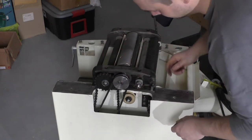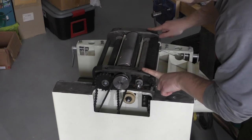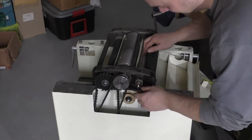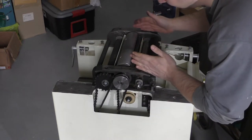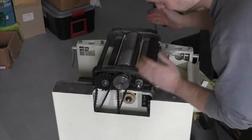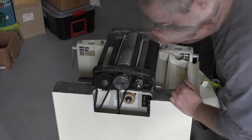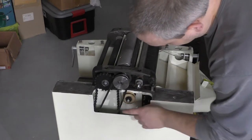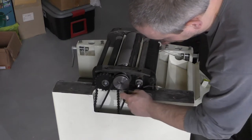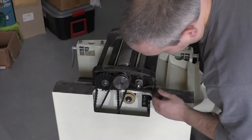These blocks go through the pieces of the frame, so there's no way to get the shaft out without the two parts of the frame being further apart, and the only way to get them further apart is to strip the whole thing down. I think there's still tension on the belt, so next I'll get the motor up and get that belt off. The chain is free already, but I'll take that off as well.